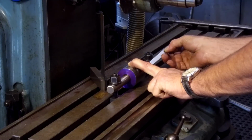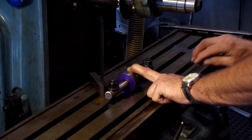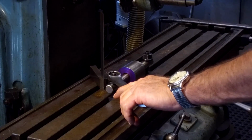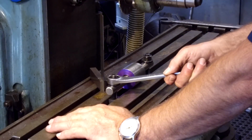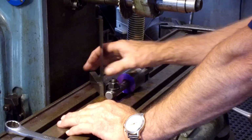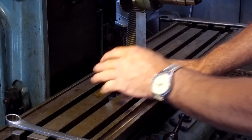All right, little pocket scale, just kind of make sure that we have a couple inches and a couple inches, and we just bring it equal here. All right. Now this is a long bend here, and I mean we can give excess force on here, but it doesn't really take a whole bunch of force because we're down in a V block here, constant pressure down, and we are square, and you could actually measure over from that line to here, that line down to there, and verify that we stayed square.